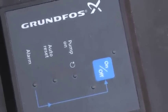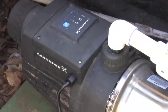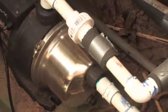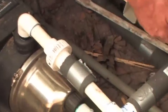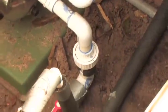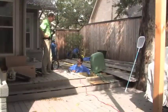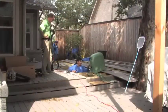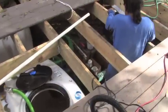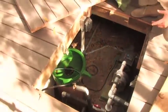This pump is a very simple on-and-off device. It has its own little fill line for when you first need to prime it. The water is coming in on this side and is going out on this side to the sprinkler system. So we're actually pulling water out of the tank and then pushing it to the zone valves of the sprinkler system. All this access is important so that if anything happens to any part of this system — whether it be a malfunction of the pump or a leak — we have the ability to come in and service it.